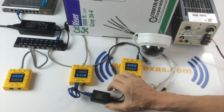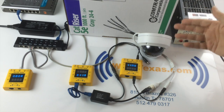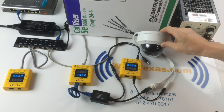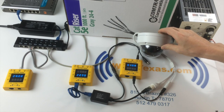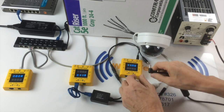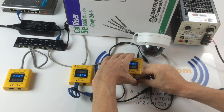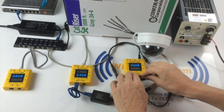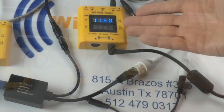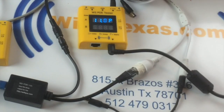So this is a setup with the 12-volt splitter. Now you can see that your camera may have large infrared loads. For example, with the lighting here, the infrared LEDs are turned off on this camera. So let's replace the load of the camera with a programmable load, which is going to take just about 10 watts. As we apply 10 watts, we now see that we're delivering 11.6 volts at 1 amp, or about 11 watts of power.